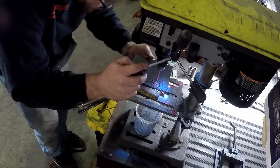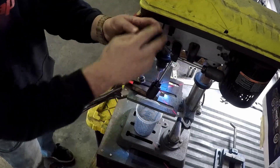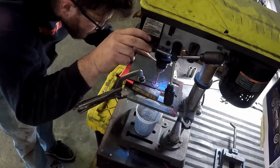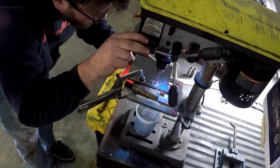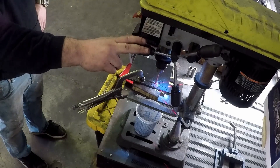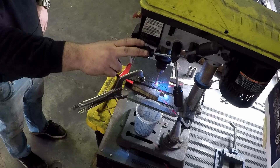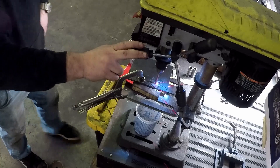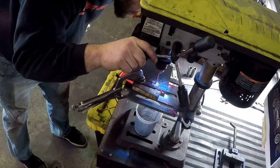I had to cut pretty big holes — half-inch holes in 3/8" steel — so I had to start at a very tiny drill bit and work through seven tool changes before getting up to half an inch. I took it easy and slow, cooling with WD-40 as I went, because I didn't want to melt the ends of the bits down in the metal. Although it took about an hour and a half, I didn't break anything, the holes came out perfectly fine, and most importantly they were the right size. This whole process took a long time — this video covers about two weeks — but I got it done.